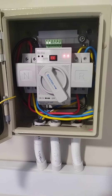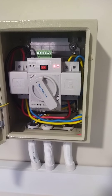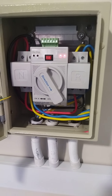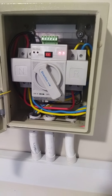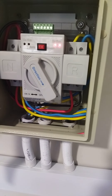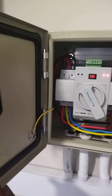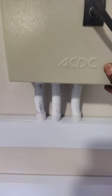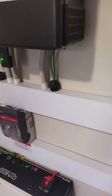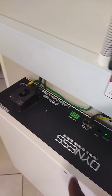I also just wanted to show you the changeover switch. We got a box and fitted our changeover switch in there. I see a lot of installers just leave them blank, open, and live — exposed to touch — which is against regulation. So if you're going to use a changeover switch of this type, please get yourself a box that it can fit in nice and neat, that locks and closes. We also have our earth wire here — we've bonded the inverter and bonded our battery.